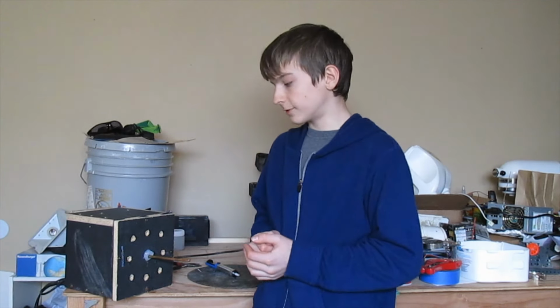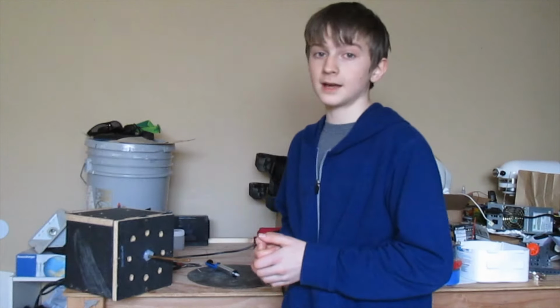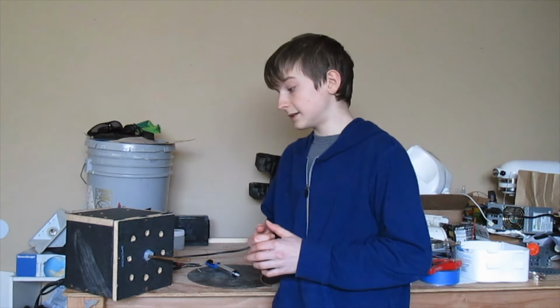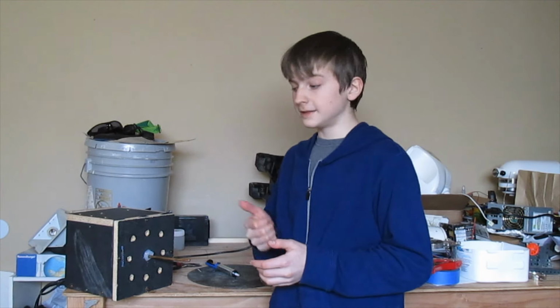Alright, so the original reason why I built the housing for the vacuum motor assembly was to utilize it as a solder sucker. That's why I used the 1/4" copper tube. That did not work because it didn't have enough negative air pressure. These motor assemblies do have a lot of negative air flow, so if you're trying to build projects where you need a lot of negative air flow, these are perfect.